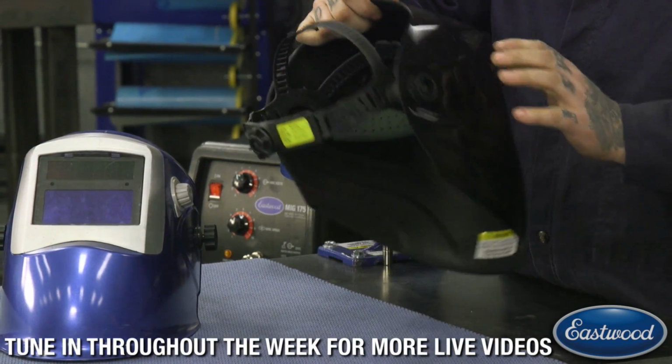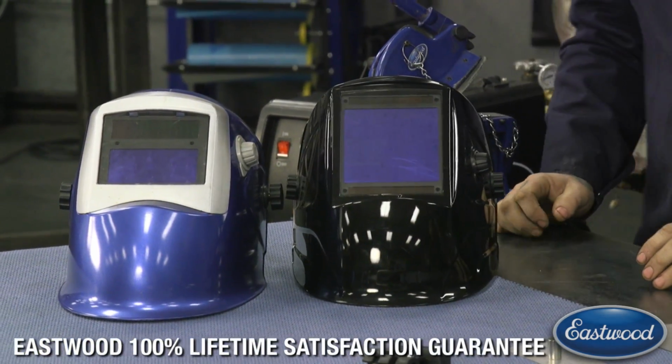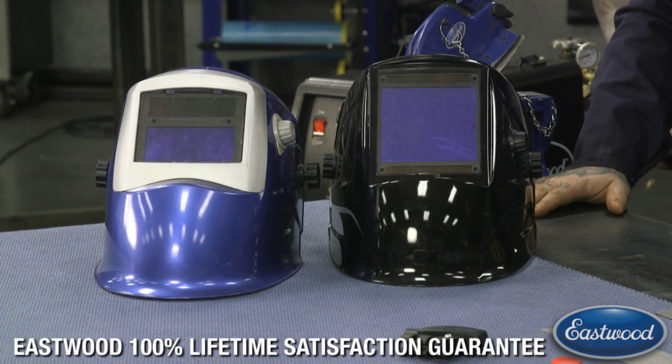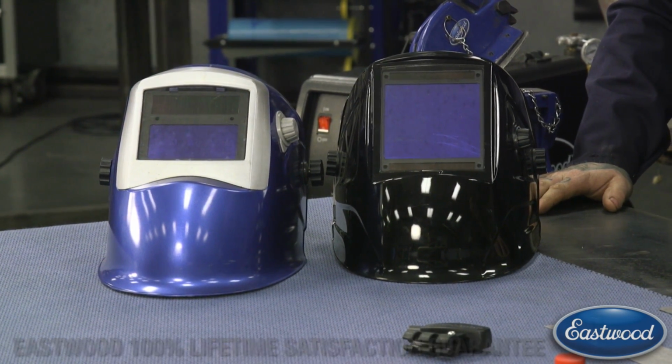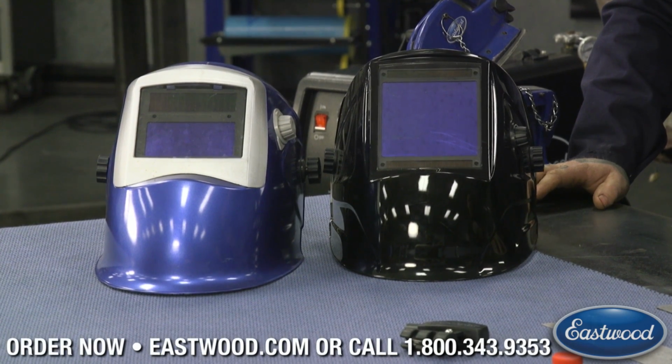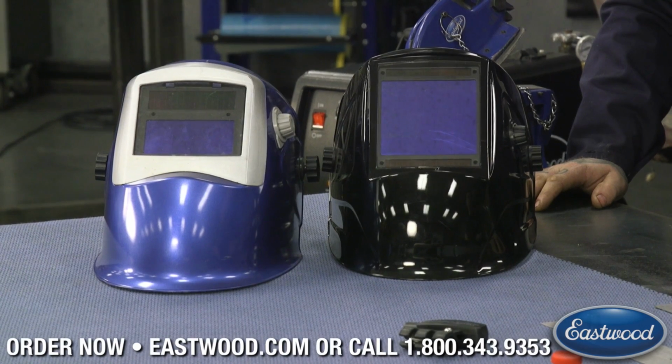But auto dim helmet is probably the most obvious thing. It makes it so easy because instead of having to do the typical head bob and then try to hope you kept your hands in the right spot, you can see right through it. It's instant when you strike the arc. And it has all the settings so you can do the delay so it goes right.